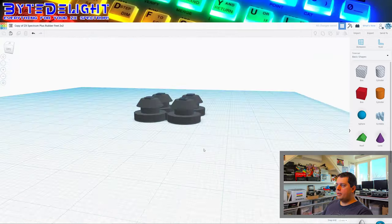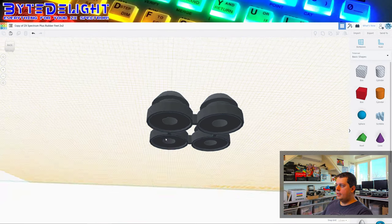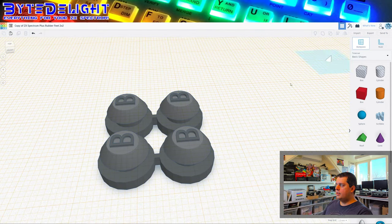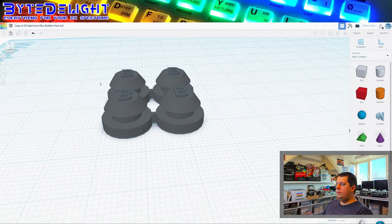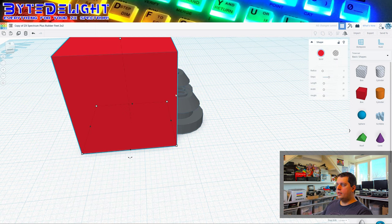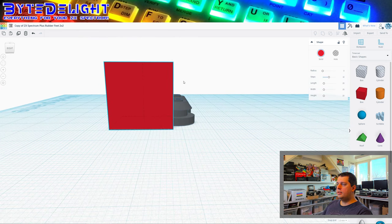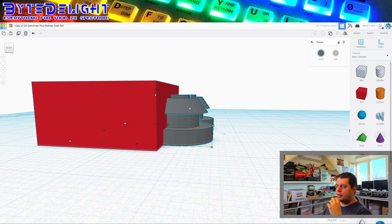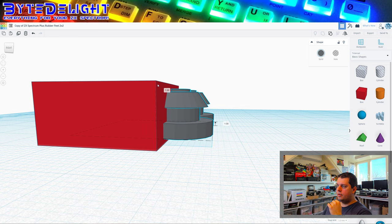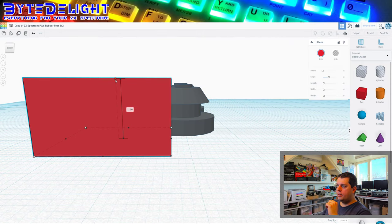You can see the bottom — there's a small indent, the same as the original, half a millimeter — these are as close as possible to the original rubber feet. The interconnects can just be cut away. The next thing is we're going to create two steel plates. I'm going to make a part which will be steel, two millimeters higher than the original thing on both the top and bottom sides.